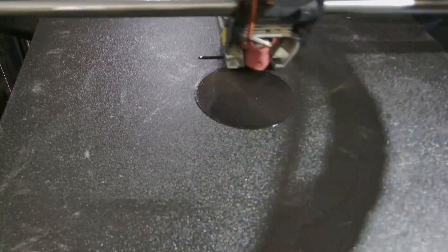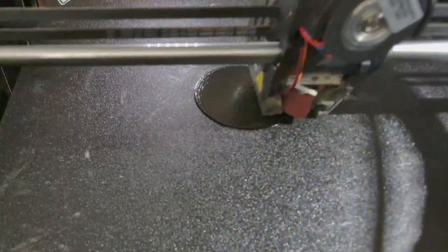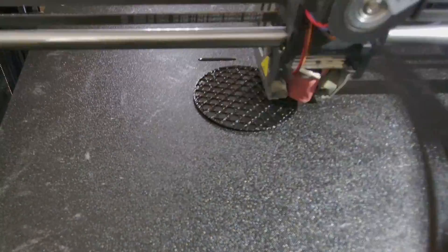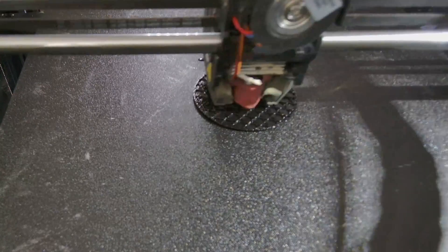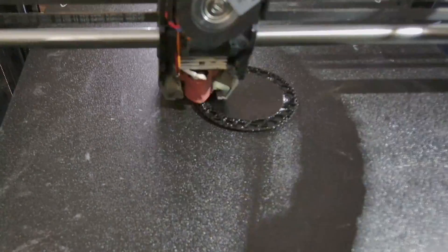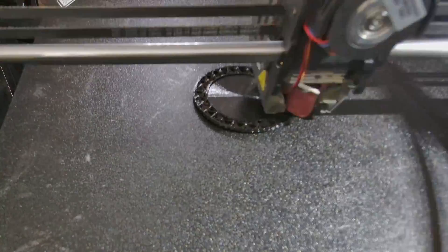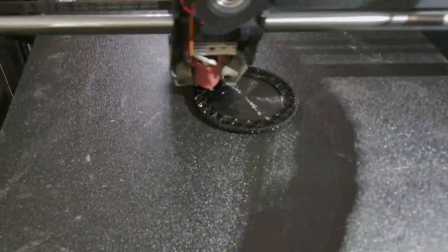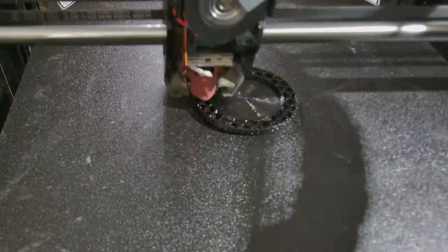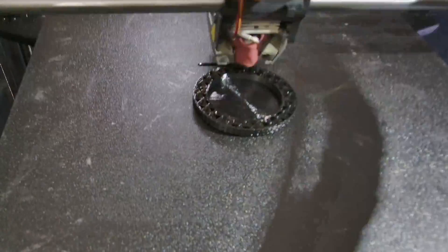For this part, if you're looking for something super strong that comes out great, I basically do two walls on most things. If you need it a little stiffer or stronger but still pliable, you can bump that up to three walls. I use four top and bottom layers on almost all my TPU prints — it seems to be a good number to ensure a smooth top layer and defect-free bottom. I use cubic infill on all my TPU prints; a lot of people use grid, but with a flexible material I want it to feel uniform. Trihexagon or cubic work well — basically anything giving support in all directions.